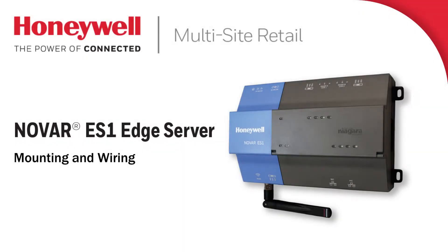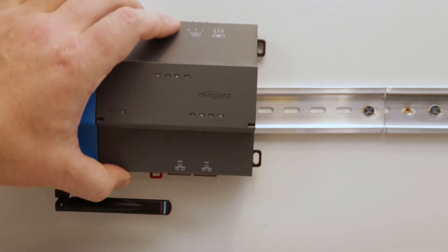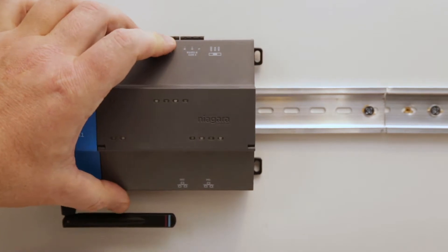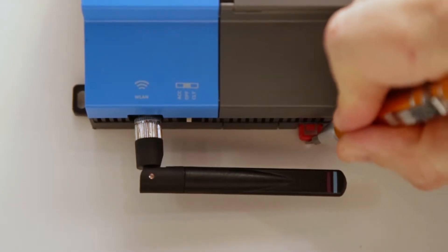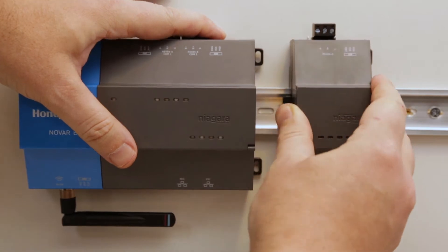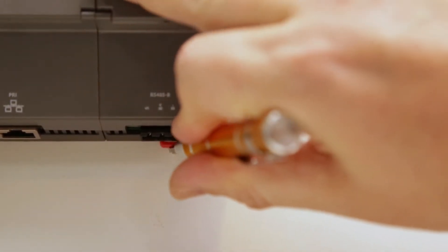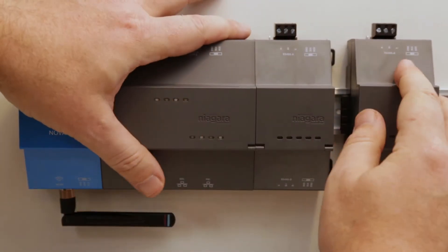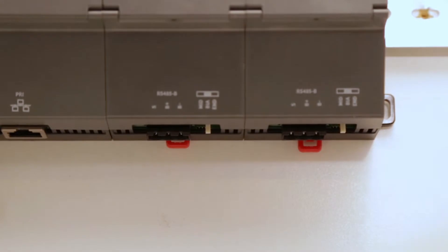Mounting an ES1 is relatively straightforward. Begin by mounting a 35mm wide DIN rail horizontally. The DIN rail offers two advantages: the ES1's unit base has a molded DIN rail slot and locking clip, as do the optional expansion modules, which make for faster installation and removal, while ensuring alignment of the quick bus connectors for direct linking of modules. As each device is added and linked to the DIN rail, the red locking mechanism should be pushed up against the rail to lock. This tab may be pulled down to unlock should the devices need to be removed from the rail.